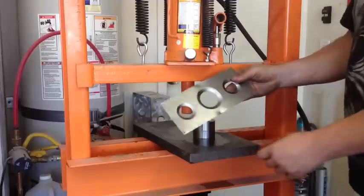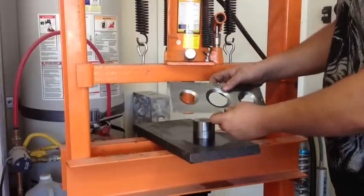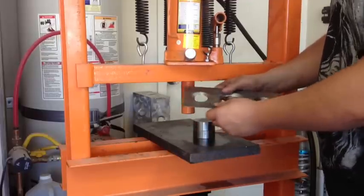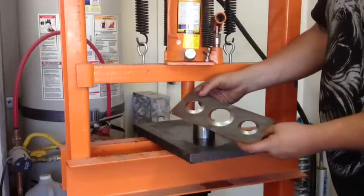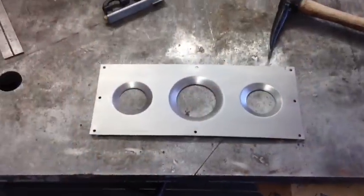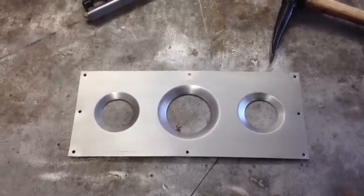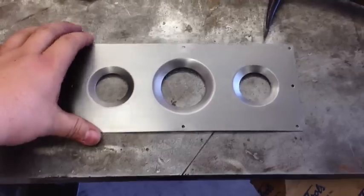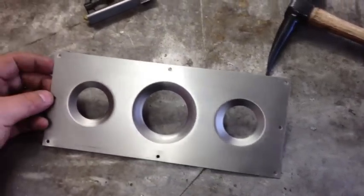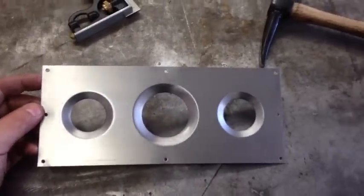Alright, all the holes are dimpled. There's just a little deformation right here, so we're going to take it up, take a body hammer to it, and straighten that out — and you'll never see it. This is 22 gauge, so it's really thin stuff to be doing this with, and that's why it's bending, but if you're working with this, you can straighten it back out. So let's go ahead and take these out with a body hammer. Alright, I call this panel done. Now it's time to take it to the paint guy and get it painted — it's going to be back on the car by noon tomorrow, so 24 hours from now. It was a fun little project, quick, easy, pretty straightforward — a nice little Saturday project. I hope someone found this useful and informational. If you have any questions or comments, just leave a comment and I'll get back to you. Thanks for watching.